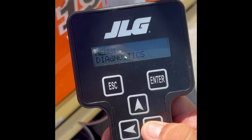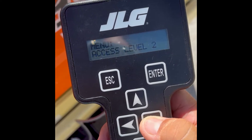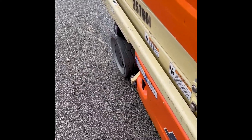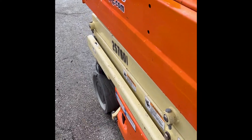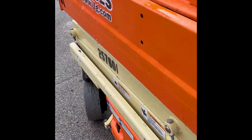Troubleshooting steps. With a multimeter, check the battery voltage between the B minus terminal of the power module and the battery side of the contactor. It should be at 24 volts. Check all of the battery cables and connections for tightness and cleanliness. Then load test the batteries.